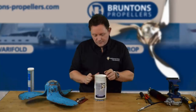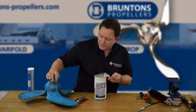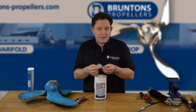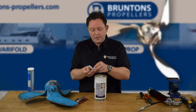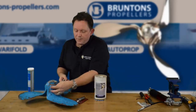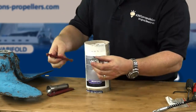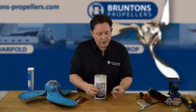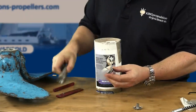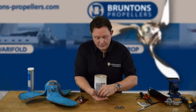Now let's delve inside what's in the kit. The first thing are the little grease ports on each hub — there are two, one here and one here — little screws that you pump the grease into. Once you've finished, it's all back together. You get little sets of grease screws with a little o-ring. Then working down, once we've taken off the cap here, you'll be exposed to these. Now these are left-hand thread — this is a tab screw. This is what this little spanner locks into, the two little holes, to wind it off. It's left-hand thread, it's engraved on, and underneath that is the locking nut that holds the blade onto the boss.